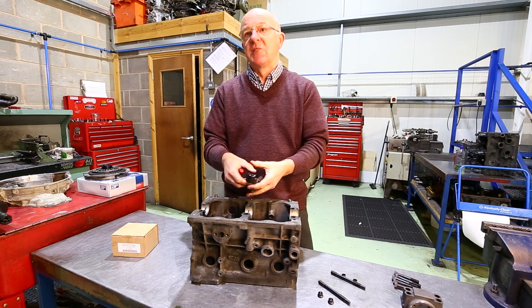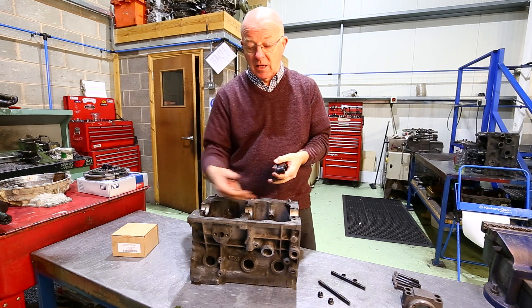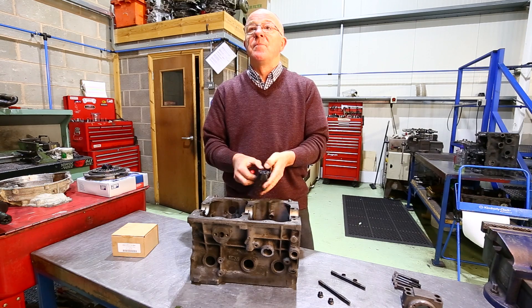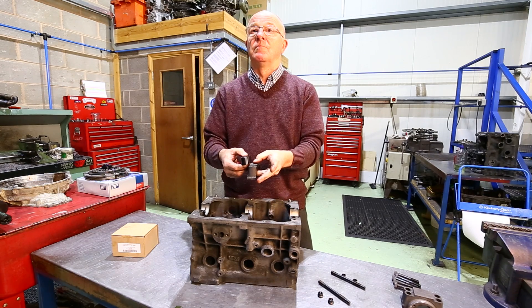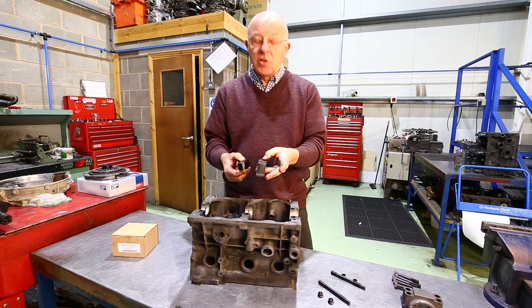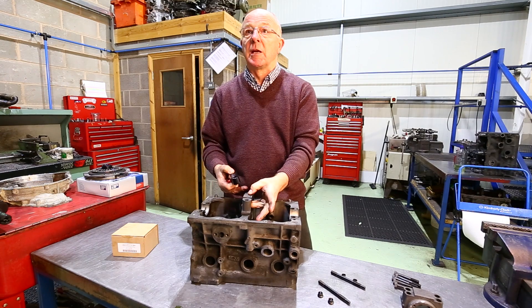The complete solution is obviously a four-bolt steel cap, but that's very expensive to fit and to line bore in situ. With this strap, you won't need to line bore the engine — it fits straight onto the original caps. It's very important to keep the original caps from your engine, because these are line bored to fit that particular block.